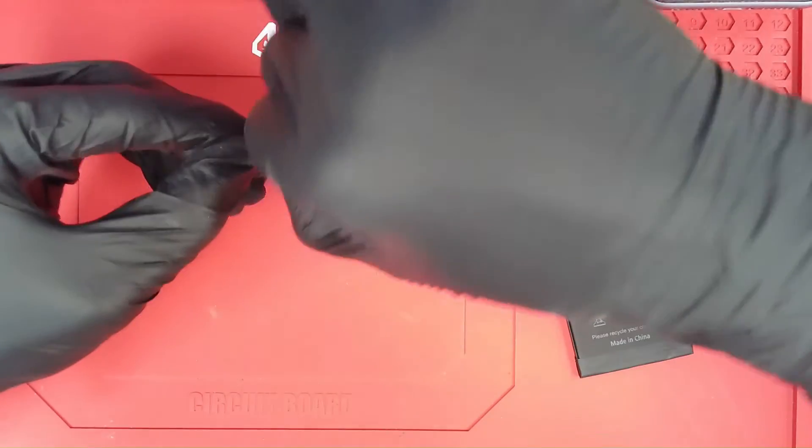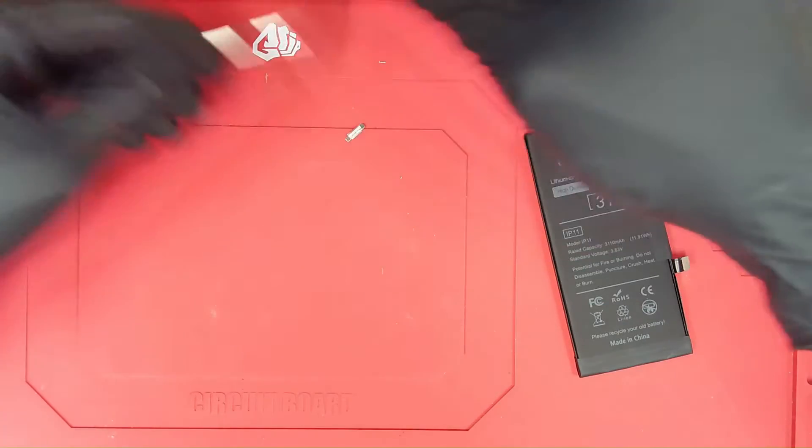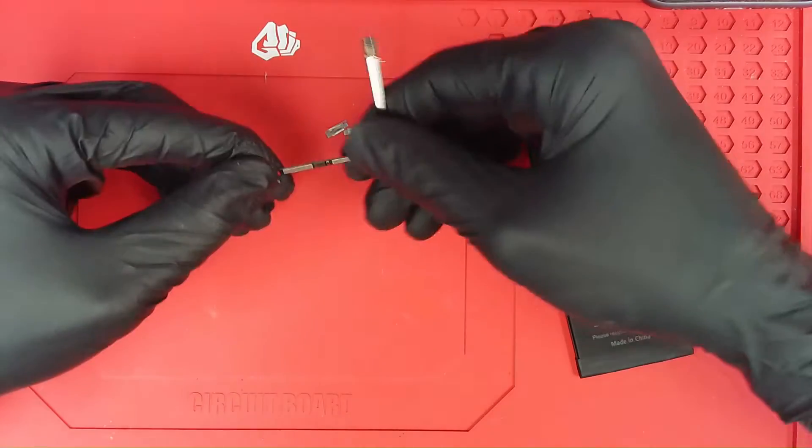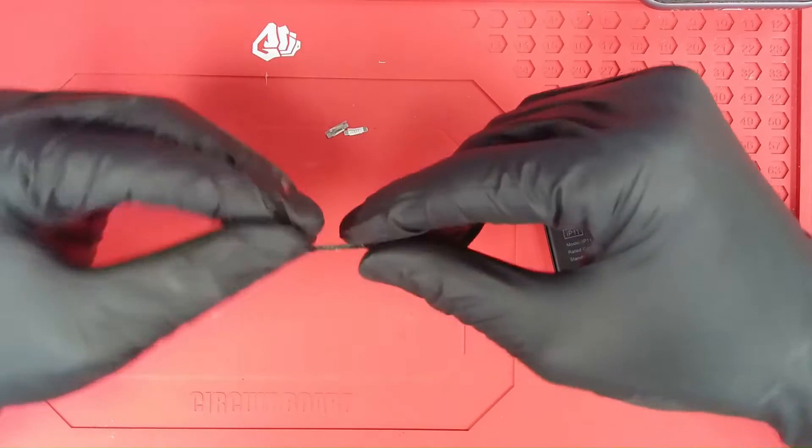Now that we have our original BMS, a little bit of prep work here. No grinding necessary, but we do want to get rid of this residual lead — the sharp edges are risky. So we'll unfold the tab as we did on our previous installation for our XCAP BMS, then fold this back and forth two or three times and go ahead and remove that welding tab. Do the same thing on both sides, just open that tab up and fold it back two or three times. Now we have our BMS ready for installation.